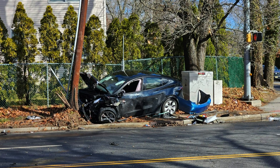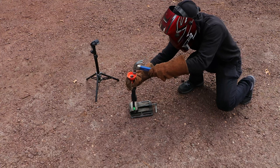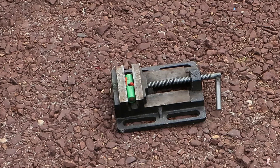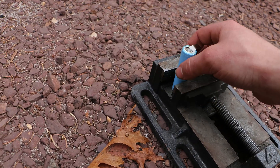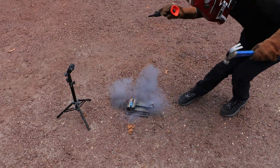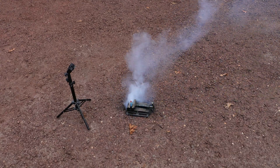The final test for today is simulating what would happen when a car goes into an accident and damages its battery. I'll use a nail gun that is usually used for concrete. That was loud. We can see the electrolyte boiling, but no explosion or fire. After removing it from the vise, there's definitely some damage — but placing it upright and trying again, this time it actually exploded from the bottom, giving off a lot of smoke as the battery was very hot from getting shorted out through the nail.